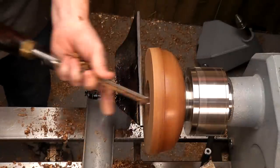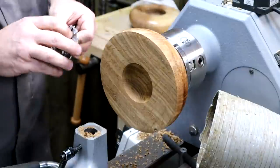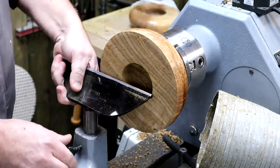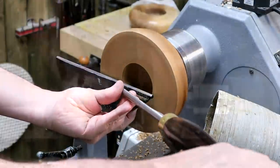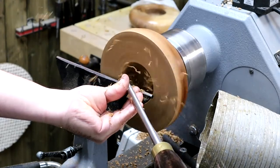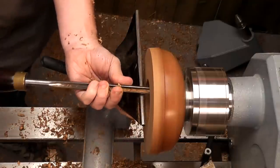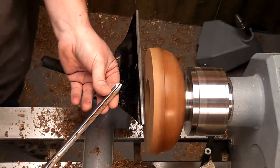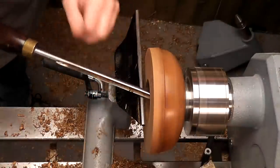We're too big, which is what we were hoping at this stage. So I'll now go up to the line. Look how far out I'm positioning the handle — I'm right over the other side of the lathe because I want to aim the bevel of the back of the tool down the line. If you start with the handle too close, the tool will generally skip along the surface. You need to present the bevel pointing in the direction you want to move. Now going to the depth I think is right.